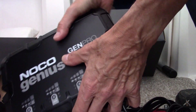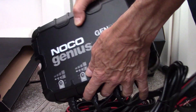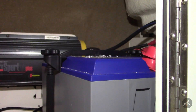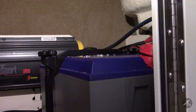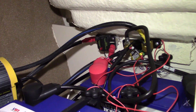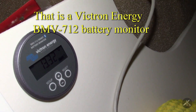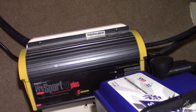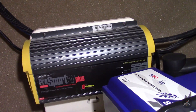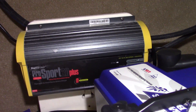So that's the unit. It's going to mount here with those two screws. It's heavy — it's like a pretty nice unit. This is a 2018 Chaparral Ski and Fish, 21-foot. They mount the batteries here. I replaced the original Type 27 lead acids with a couple of 100 amp-hour Battle Born lithium ion batteries, and I have a battery monitor mounted there. There's the original Pro Mariner 20 Plus charger in that spot, and if I measure correctly, I ought to be able to unscrew the old charger and drill a couple of new holes and mount the new one right there.